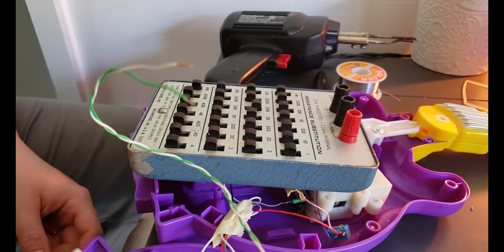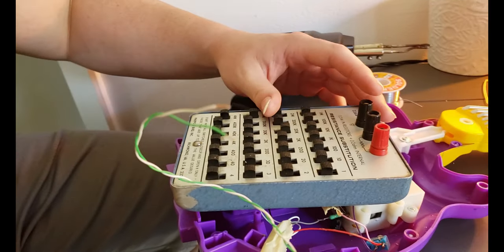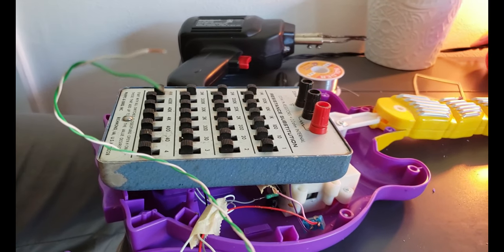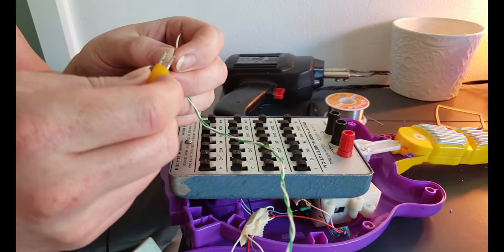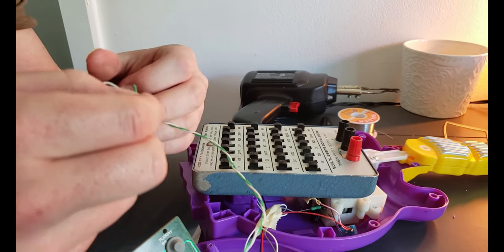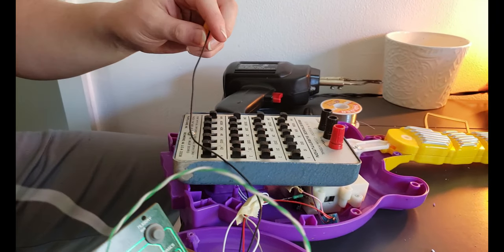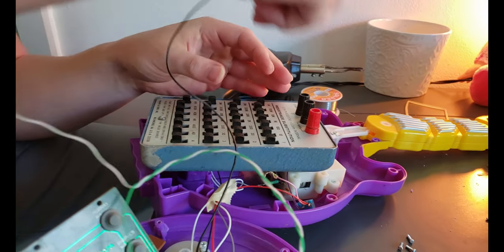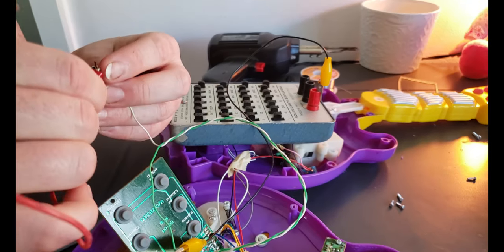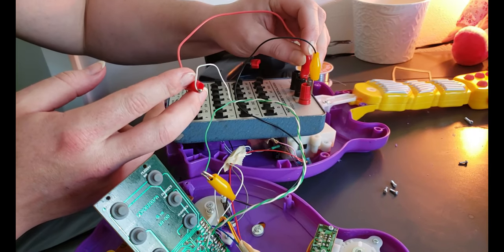Now just to play it safe, we're going to go ahead and use a resistance substitute right here, just so we can figure out how much resistance we can actually use without crashing this instrument. Or I should say, how much resistance we can afford to not use before we crash this instrument. So I'm going to make sure these two do not touch in any way. We're just going to put one over here, and I'm going to plug this up. If you haven't seen me use this before, it is a very nifty little tool that helps us find which value of resistor we actually need.